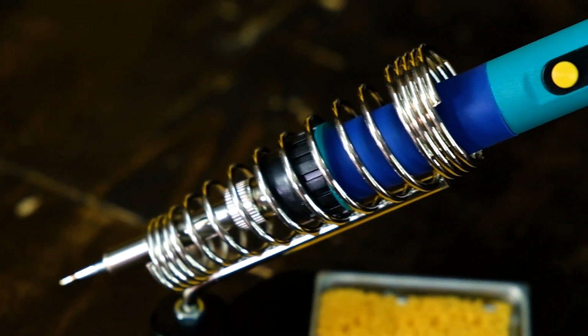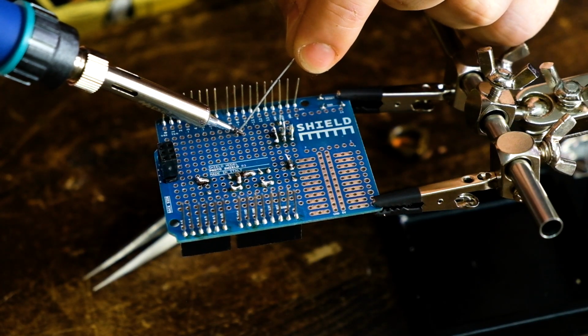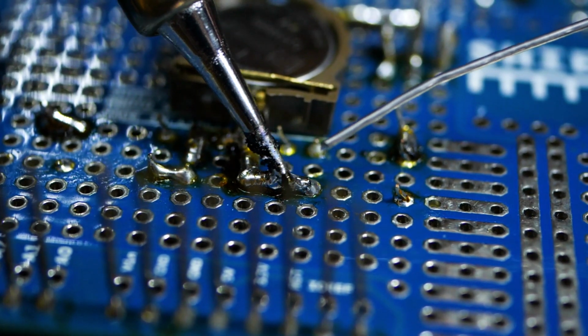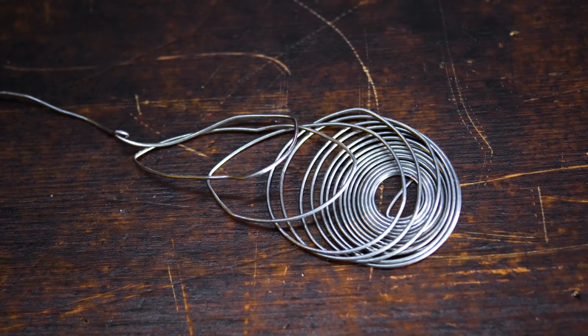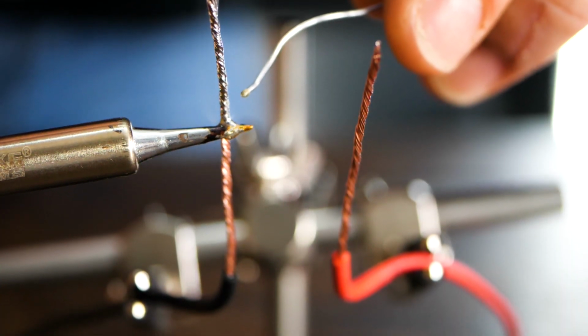Soldering is a process similar to gluing, but instead of an adhesive, we use molten metal. We just take two parts and connect them with molten metal. When the metal cools and solidifies, it holds the parts better than adhesive. When we solder two parts together, we use what is called solder. Solder is a metal alloy that has a low melting point. The temperature at which solder begins to melt is lower than the melting point of the parts being bonded.